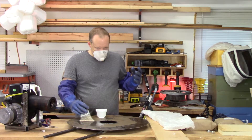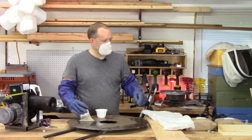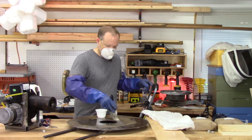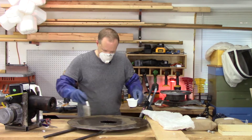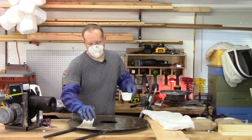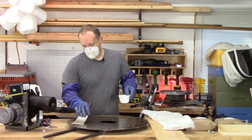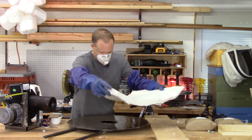I'm also going to have to cover all this stuff with a layer of either Satanite or Mizu — they're both castable refractories or high-temperature mortars. The problem is you don't want exposed ceramic fiber, because as it gets fired in the furnace it'll break down and release fibers that are really not good for you. So you want to cover those — let's just go for it.